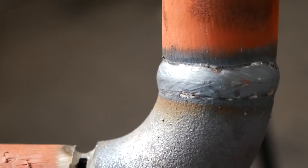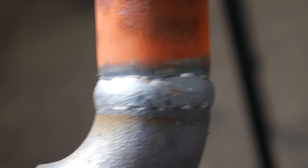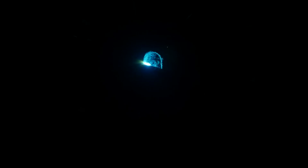You can see my prep here: on all my pipes I have one side fitting prep and the other side a straight cut. I tack it together and then use the nine-inch grinder — or in this case the five-inch grinder — to cut the tack back as well as prep the other side of the pipe. That saves me so much time, and the tacks are feathered down to nothing so I can go over them easily. On such a small pipe they burn away to nothing because they're not holding any weight.